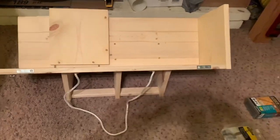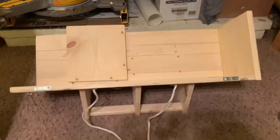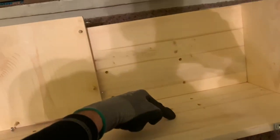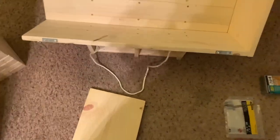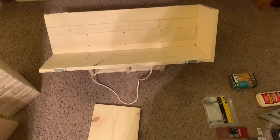Let's take a look at the case I designed. 60 blocks stacked up measures 29 and three-eighths inches. I measured my case a little bit long — these boards right here are 29 and seven-eighths — because I don't want the blocks mega tight. Both end boards you're going to measure nine by ten. I just reused some rope from another project; you're going to want to use something pretty substantial because this thing has got some weight once it's all set up.